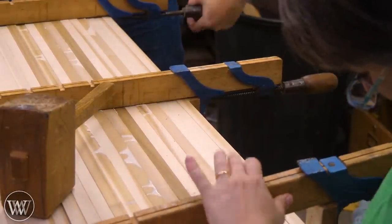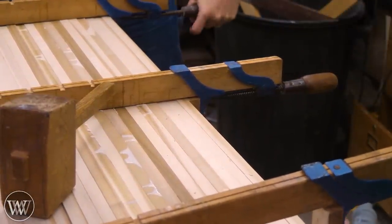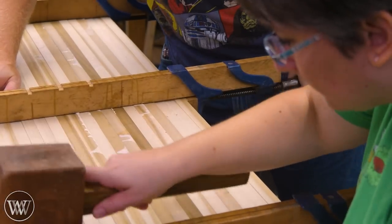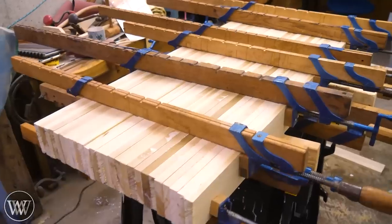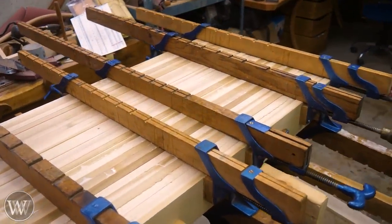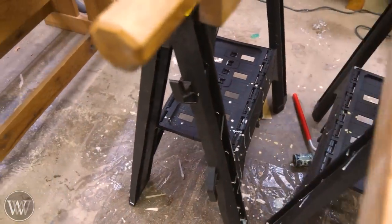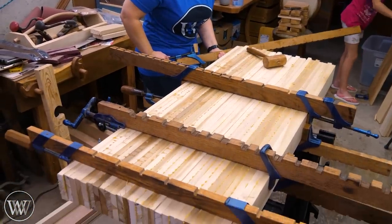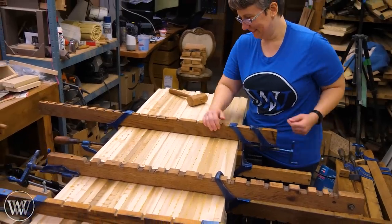We were wrong — very, very wrong. It went pretty well, but we ended up with a twist in the boards that was a little more than I would have liked. But you live and learn; that's part of making your first project. We got them all laminated and clamped up — you want about a clamp every four inches to get proper pressure. You need a lot of pressure for lamination, so get good clamps.